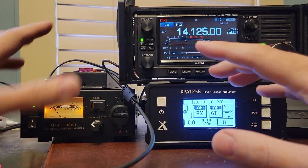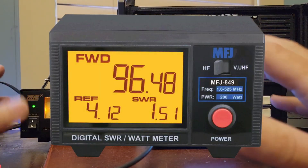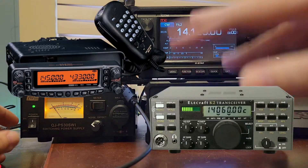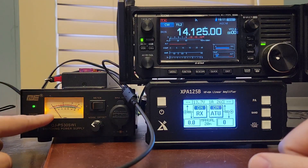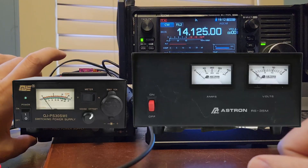The reason why this isn't going to work: I have an amplifier here and I've got a whole bunch of other accessories I like to run on my desk. I like to have a power meter and some other stuff going on, maybe two radios — one to listen, one to transmit on. You need more power. So this is a 30-amp switching power supply.